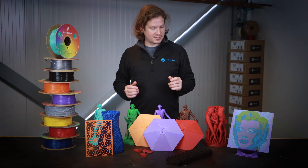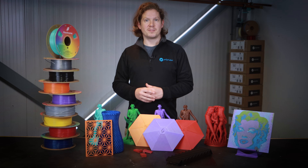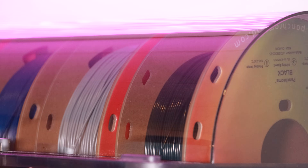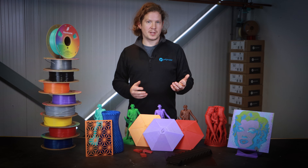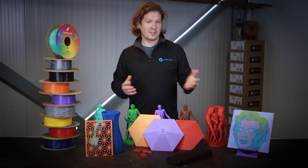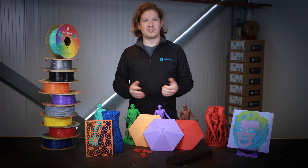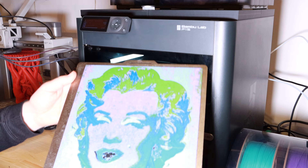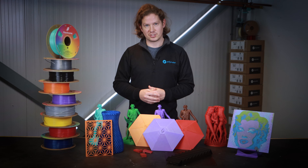To test this, I've printed out a Hueforge that I made last month for Formnext featuring Marilyn Monroe, simply adding Co-PE colors into the AMS and pressing print. Obviously the TDs are completely different, but Warhol famously played around with colors when creating this artwork. Focusing purely on the printing element, I was very impressed to see the Hueforge worked the first time on a profile that was designed for Polyterra PLA. This Hueforge was printed on a textured PEI sheet with a bit of glue, which helped release the print after it was finished.